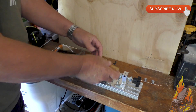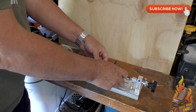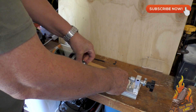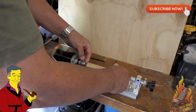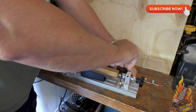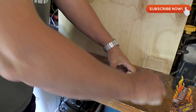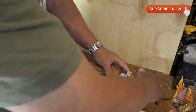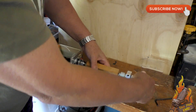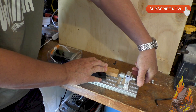Here's my bit of timber that I've got ready to put into the lathe. I've already marked the centers and put a little hole in it — not very deep — just so I can screw that into the screw in the chuck. So we're just screwing it in — there we are, that's in. Now we need to move up the tail stock, put the live center into the hole that I drilled, and tighten that down. Very easy, very simple. Then we wind in that live center so that it's all nice and tight, and then we do up the lock nut to make sure nothing moves.